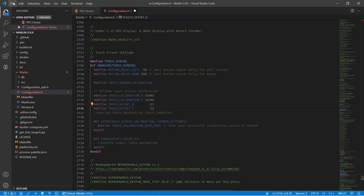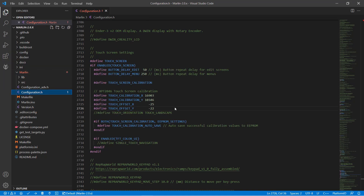That's all we need to change. If you want, you can also customize some settings like the preheat constants or the number of points that the 3D Touch probes. You can watch my other Marlin firmware videos if you want to do that — links are in the description. To keep this simple, we will just keep the default values and compile the firmware.